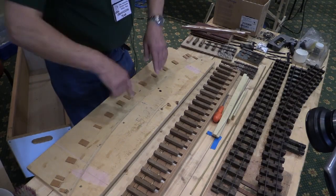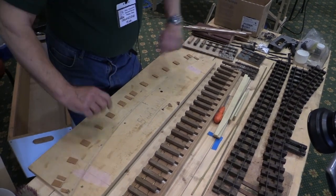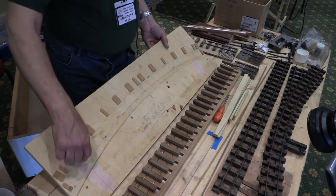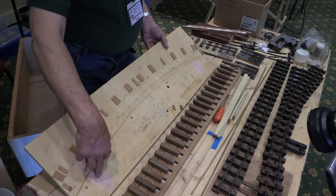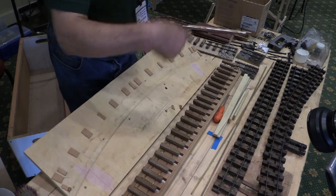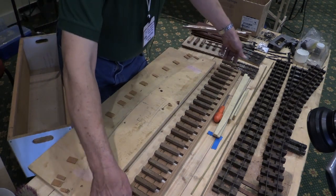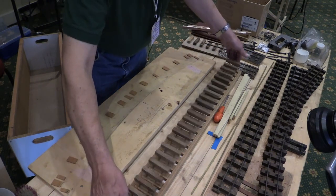But you could theoretically go down to a 4-foot radius, but it'll need more jiggling about to get it into the jig. So that's basically a jig, a piece of MDF, a piece of plywood, cut to the radius, lapped on, and these are little bits of hardwood, same principle as the straight one, to hold the rail. So to put it into here, out of the jig again,